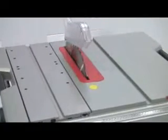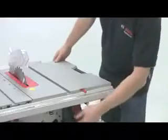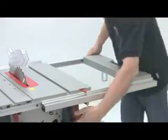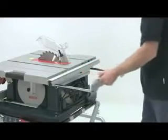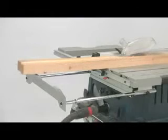The large diameter pneumatic wheels can cope with any of the rough or uneven surfaces that you are likely to find on site. The extra large cast aluminium table top provides plenty of accurate support for the workpiece, but for larger sheet materials it can be expanded out to the right very quickly and easily. This gives you a maximum rip capacity of 635 mm to the right of the blade and 250 mm to the left. For longer work, a rear table extension can be pulled out to give a further 390 mm of support.